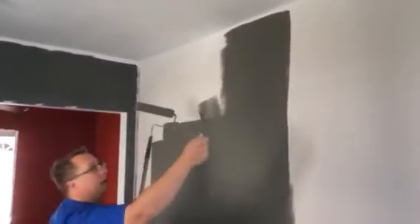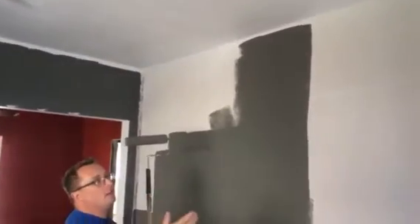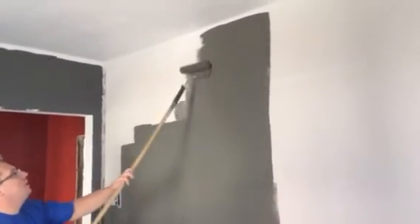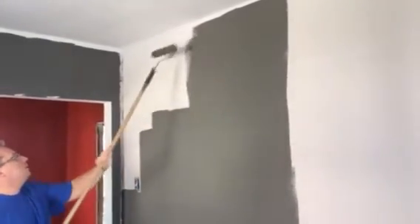You cut in or trim out the wall — I don't use tape. It's a waste of time to put tape on the ceiling. If you ever hire a professional and he asks you for lots of painters tape, you need to hire somebody else. Instead, you'll just take your brush and cut in the corners. The more you roll, the less you have to actually put on your brush and the less you actually have to paint.